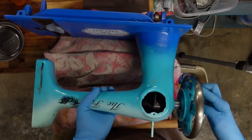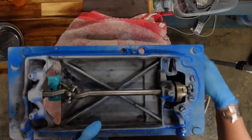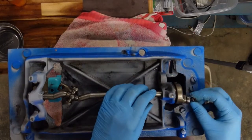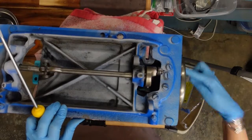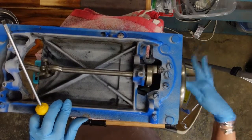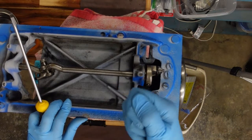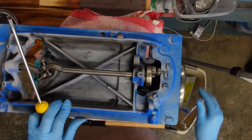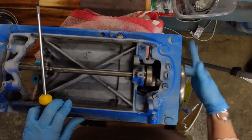I have a little nut I need to attach over here to keep it on, and then we can go on to the next part. I think I had cinched those screws down on that clamp a little tight, because even though I had oiled everything really well, it was a lot harder to turn than before. So I just backed each one of those screws up from super snug tight to about a quarter turn freer, and everything is good now. I also put a lot of oil in the slides that were down in the casting.